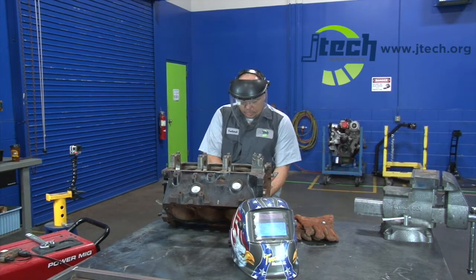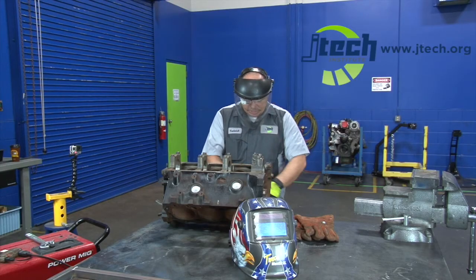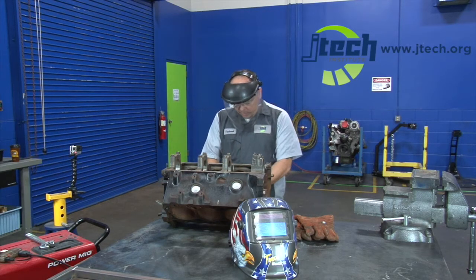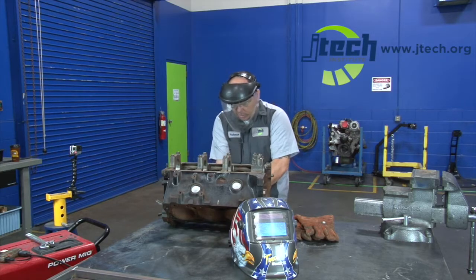You want to make sure you wear a decent quality glove. What you don't want to do is wind up getting your hand near that grinding wheel — even just tapping it can give you a pretty good laceration. So you want to make sure that you're working safely.